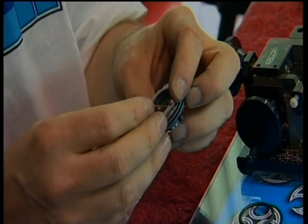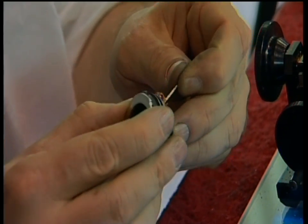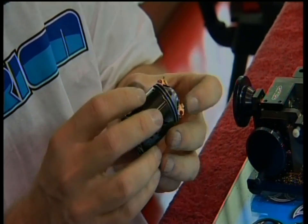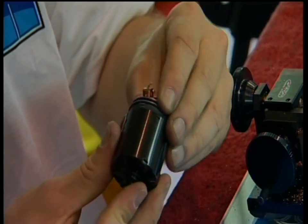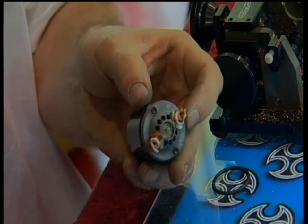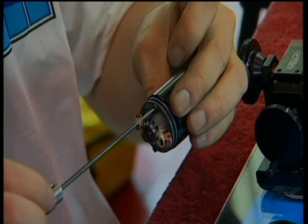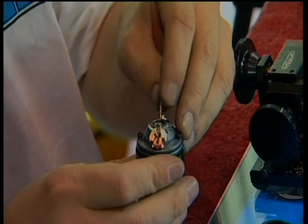You pull it slightly till the top and while you hold the pressure you make a turn. The brushes hold inside. You do the same for the other side — pull the wire straight, put it in, pull it up completely, make the turn again and it is done. Then check if all the shims are correct. For this motor we need only one shim. Put it on, close it together. Very important: before you open it, make a small stripe on the can as an identification of where the timing was. Put the motor can back in the same position, take the screwdriver, touch it just hand-tight — not over-tighten it. Just tight is enough.